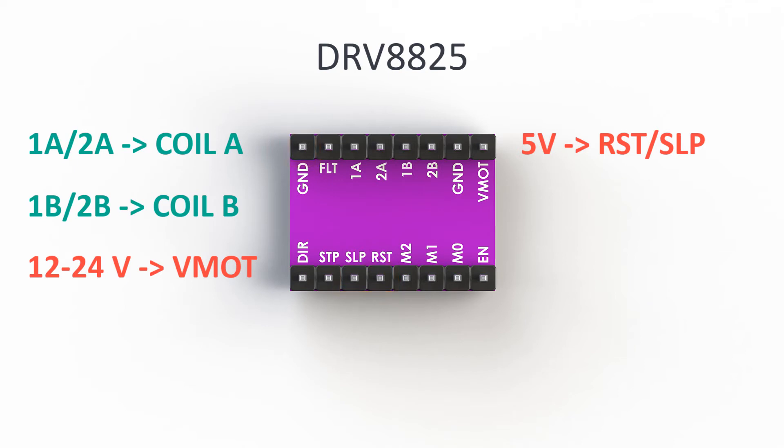From this we can see that to make the motors work we need two power sources — 5 volts and a minimum of 12 volts. It's always a good practice to separate these sources so that the motors don't damage the rest of the electronics. For right now we will use two different types of batteries: one to power up the logic and the other for the motors.